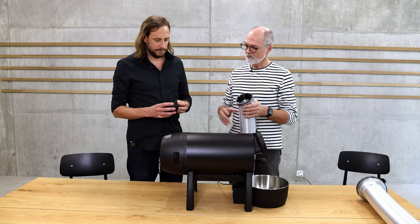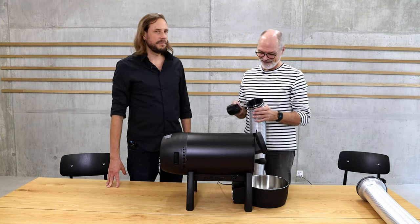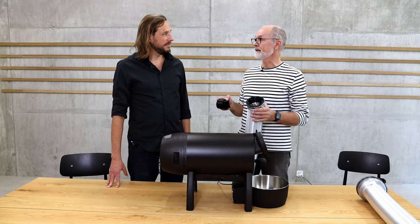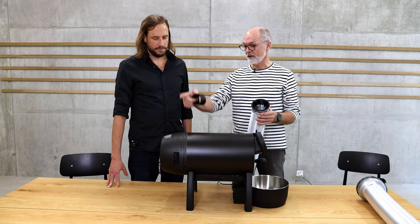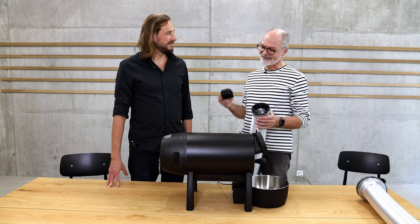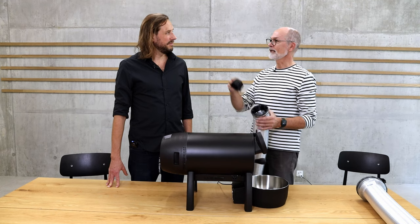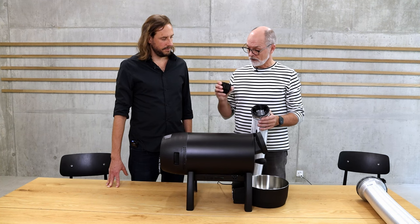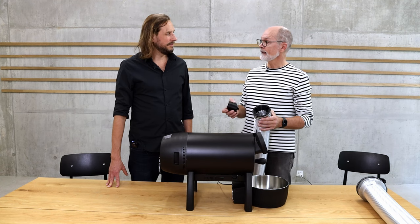There are two things that are important, and they are interconnected. First of all, you need to use a material that can actually withstand the heat. As I said before, the heat coming out there is around 200 degrees Celsius as a maximum. Pretty soon, when it's leaving the Bullet, it will go down to maybe 100, 120. The material we will be using is typically ABS, or nylon.